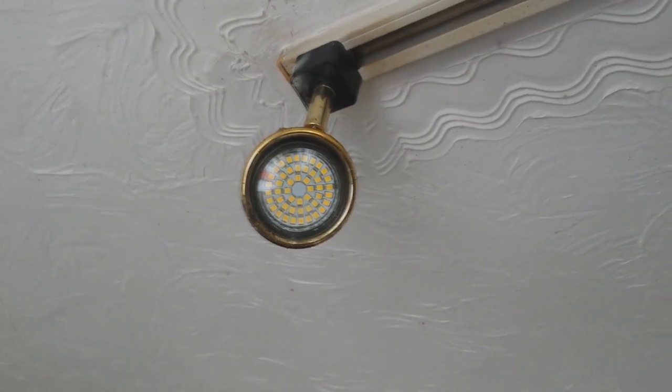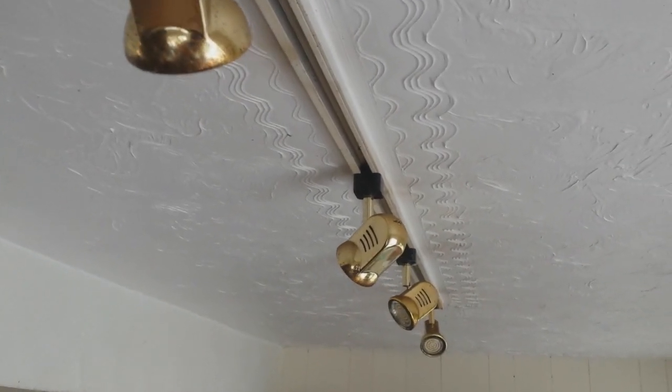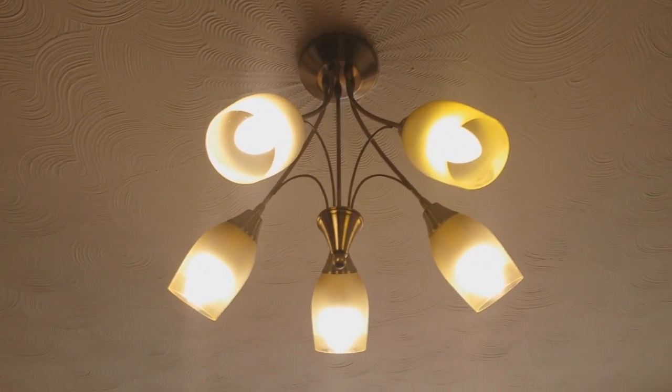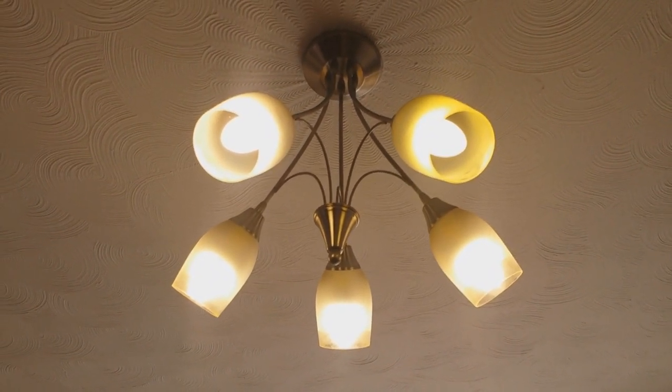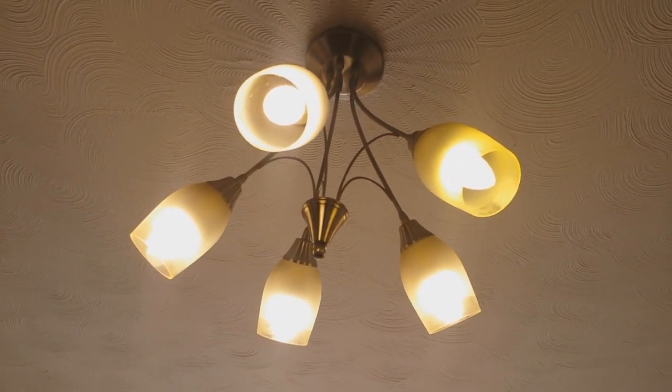Just to show you an example of the lights we're using: in the kitchen we've got GU10 LED clusters, about 4 or 5 watts each, and there are 9 of these in total. In the bathroom there are some Edison screw spotlights, and there's also a 12 volt MR11 just above the shower. In the living room we've got 5 small Edison screw candle bulbs, about 3 watts each, and a few more out in the hall. In total 28 bulbs have been replaced with LEDs, which reduced the power needed from a whopping 1.3 kilowatts down to just 150 watts — well within what the 300 watt inverter can handle.